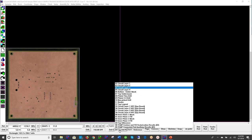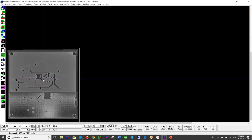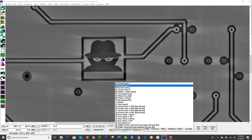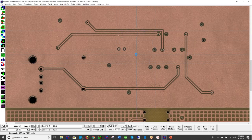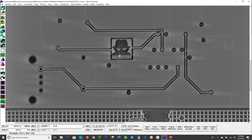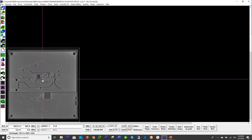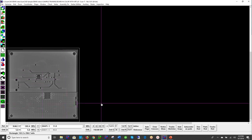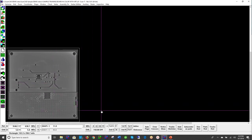We're going to talk about counterfeit parts a little bit. This is an example of a counterfeit part — someone has intentionally done damage to a layer that you can't see from the outside. Here is an image of the part in color, and there are actually two different boards. If we come down into another layer, you can actually see that someone has integrated a circuit in this board where it shouldn't be. This system can be used not only for reverse engineering but for counterfeit board and component detection, because we can overlay CAD data with images and verify what you see is what you get.